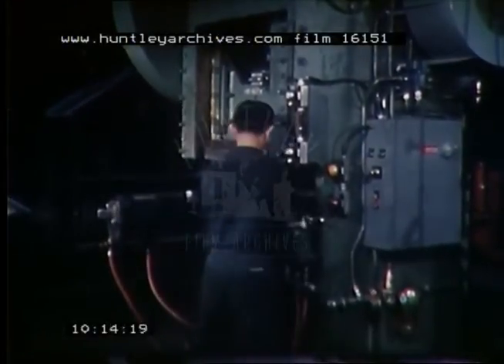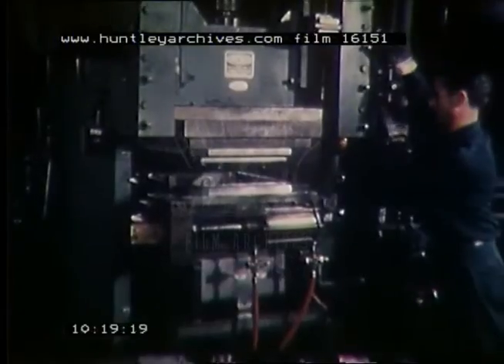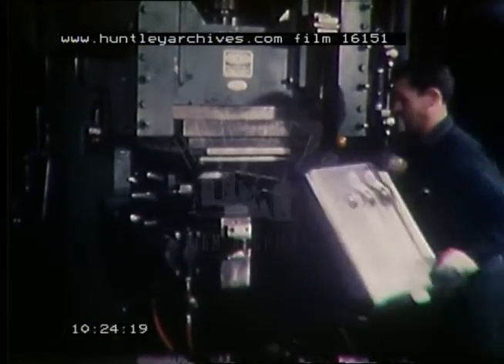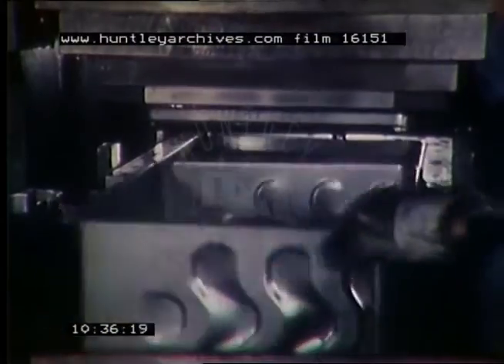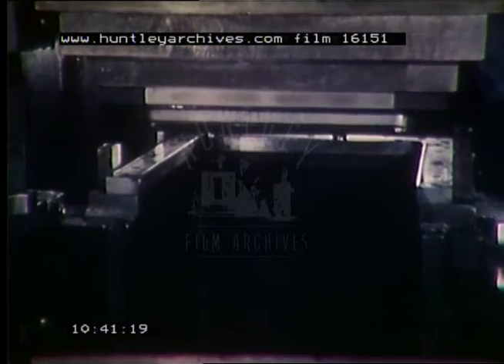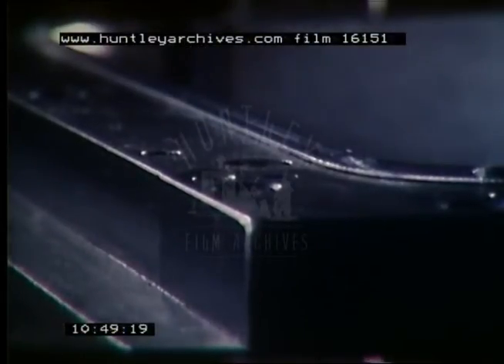Here in the Hot Point Company Chicago range plant is a single crank straight side press designed to meet customer specifications for a special application. This machine was built with extra high die space of 39 inches to accommodate oven liners used in Hot Point ranges. This model 5½-32 is one of several in this customer's plant. The press is used to flatten the front flange and form the bead on the outside edge of the oven liner flange. For easy loading and removal of liner, the die is made in two sections — a stationary rear section and an air-operated hinged front section.